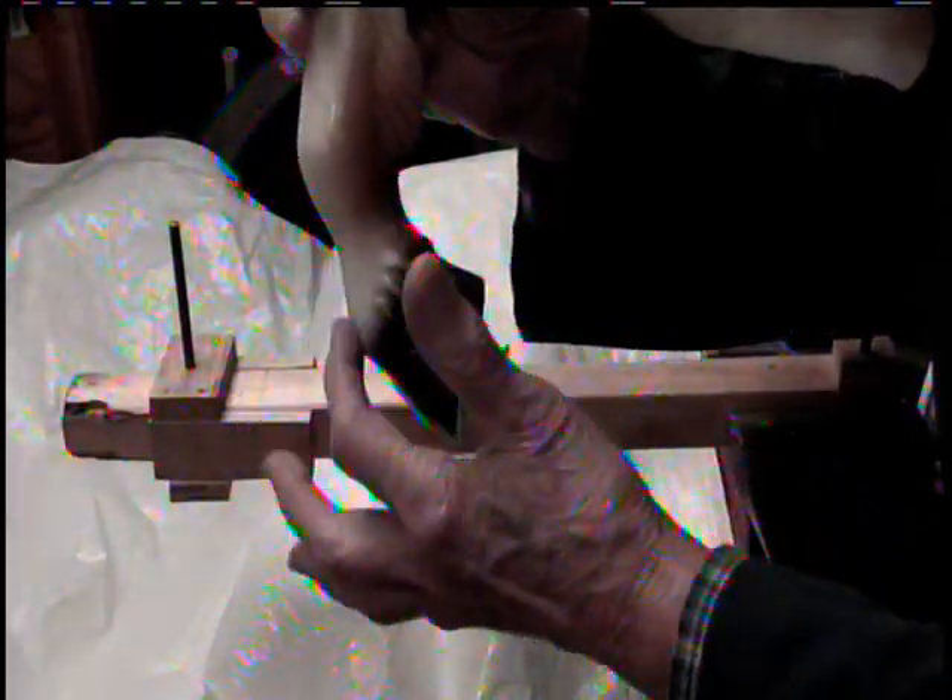Here are the construction details of the leg — this is the front leg on the left side. I drilled a hole and put a little bushing inside so the screw that holds it isn't working directly on the plastic leg. On top, the dowel that went through there for the children's legs I cut off; it happened to fit nicely and makes a good pivot point. I determined the width at an inch and a half to give the proper width on the mounting bracket. For the knee hinge I used urethane rubber — I formed some in a color close to the horse's color. It flexes any way you want, it's durable, and if it wears out it's very easy to replace.